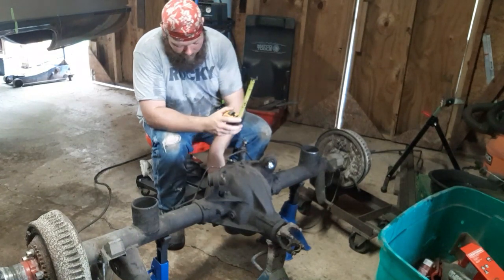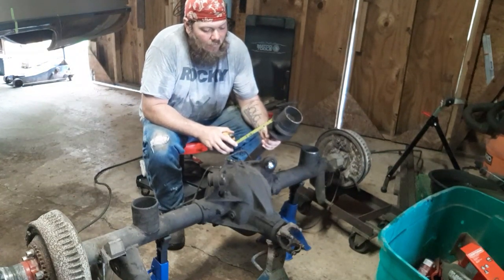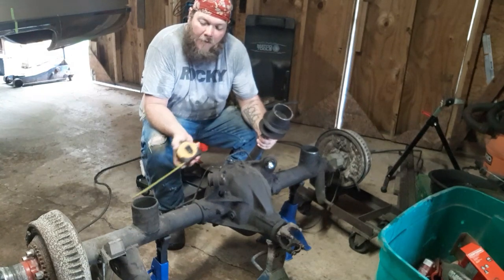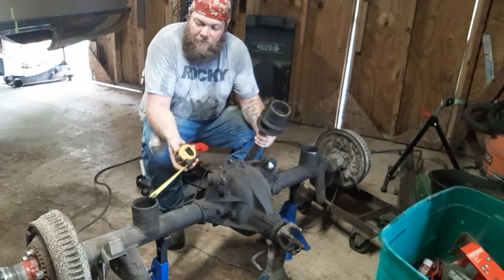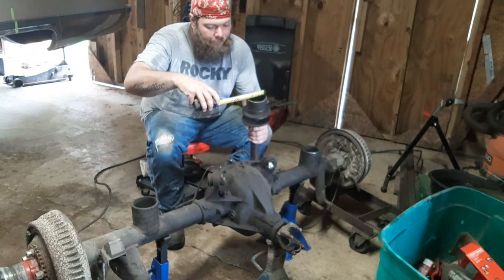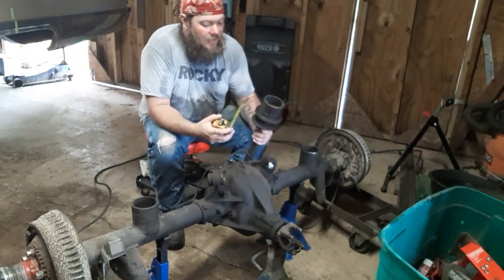And we have factory, but we have just basic coilover cups. They're about 1 inch deep. And he had a problem with them popping out on the top of the coil when you three-wheel. So I basically got the same material, 3-inch pipe, 3.5-inch OD, 3-inch ID.